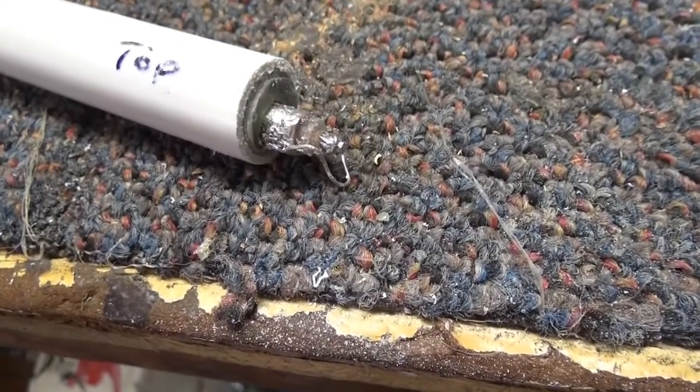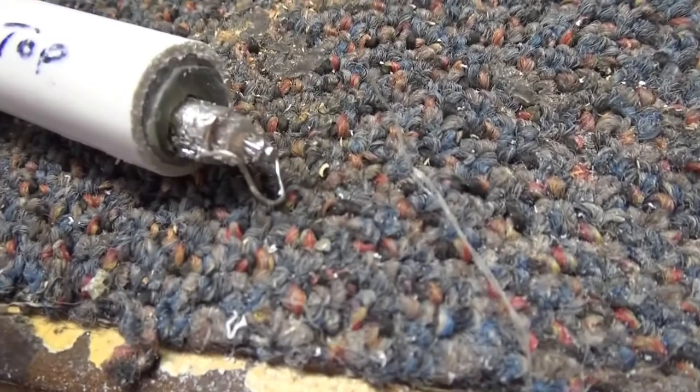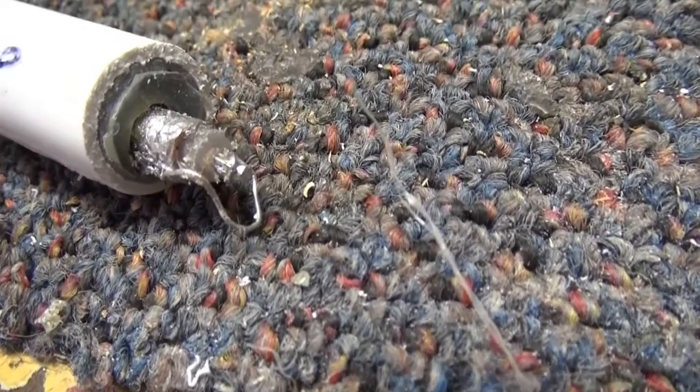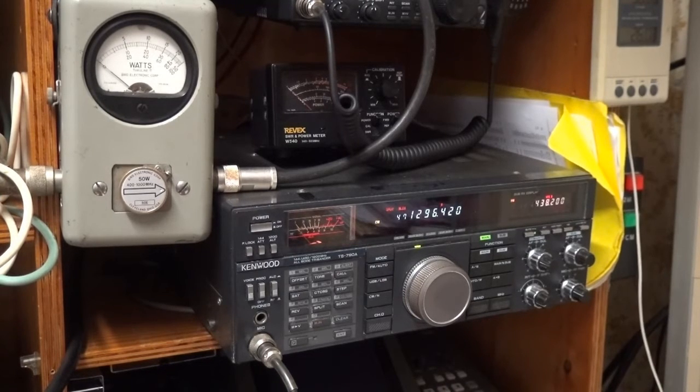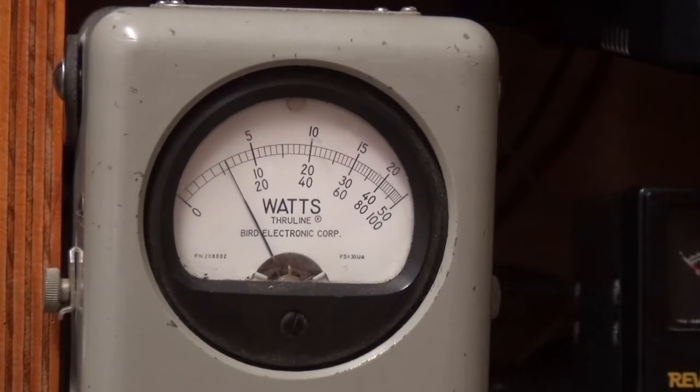I've finally exposed the end of the antenna and this is how we adjust the SWR. I'm going to take it inside and see what it's reading — either lengthen or shorten. I've got the rig tuned to the duplex beacon at 1296.420 and it's coming in quite well. When I transmit at 1296 the rig puts out about just over 5 watts, and when I turn to reverse SWR it's barely lifting the needle. That's pretty good.